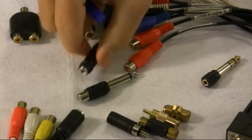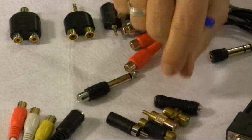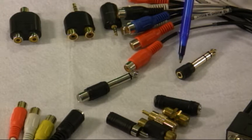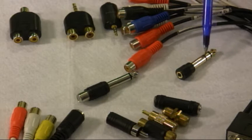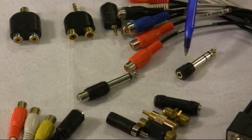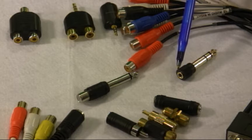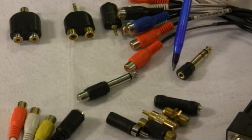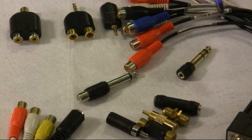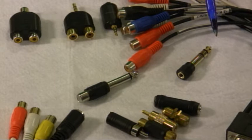And then of course this one connects two pieces of coax cable together. This one is just 3.5 millimeter on either end for connecting that sound cable together. And this one is great because frequently on your mixing board you'll have the quarter inch — this is actually a stereo, you can tell by the two black dots. On the other end it's 3.5, so it's quarter inch for your mixer side and 3.5 millimeter, or what would be called eighth inch. Available on the internet — if you get the ones from China, some of them worked and some of them didn't, and it wasn't really worth sending it back for five dollars. I try to get the ones in the States when I can.